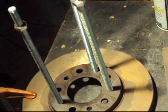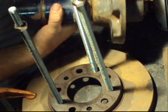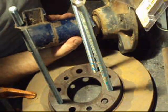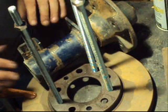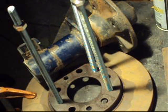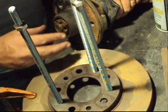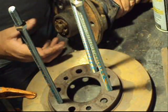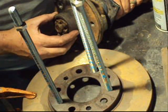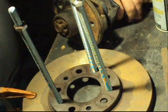The next part will be putting the magnets on and possibly casting it. We also have to take this bearing assembly completely apart and clean all this up. The seal in the back is bad, so we've got a replacement — it says grease seal, 1.719, fits 3,500 pound trailer axle. I'm Scott Brown with Green Wind and other home energies. I've got a lot of footage and a few things got done out of order, so I've got a lot more video coming up. The magnet rotor will be next. The next one we're going to show you how to take all this apart, get it all cleaned up, inspect it for damage, maybe put in new bearings, grease it all back up, and show you how to pack the bearings — great for when you do a brake job.